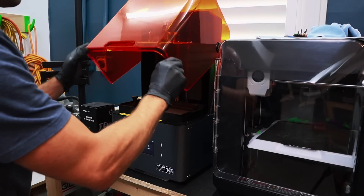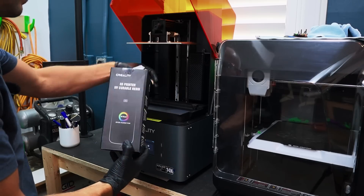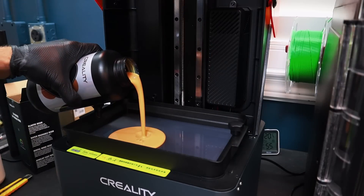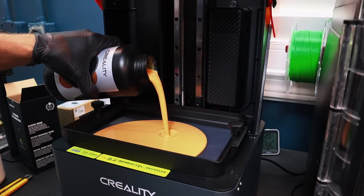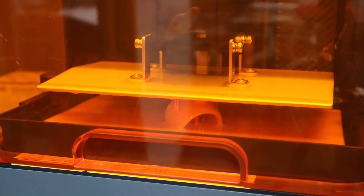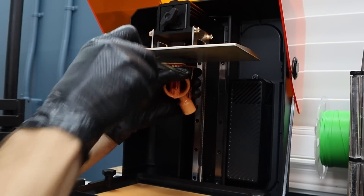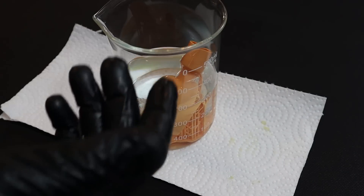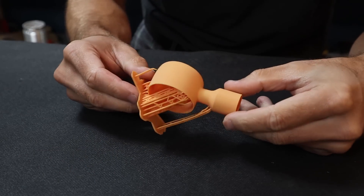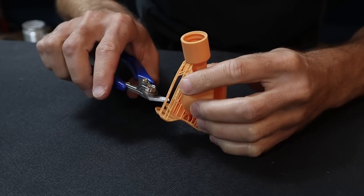Let's go ahead and print one of these to see if we can reproduce what we saw in the simulation. For this I've used my resin printer — and if you can believe it, this is my first time using a resin printer ever. I moved to resin because at this scale I think it's going to work best and give much smoother surfaces, which should help reduce friction inside — and we really need that precision for those narrow openings. I don't have the wash and cure station, so I've just cleaned it in a beaker of alcohol and cured it in the sun for a couple of hours. The color has changed a little more to orange than I was expecting, so I just need to remove the supports.